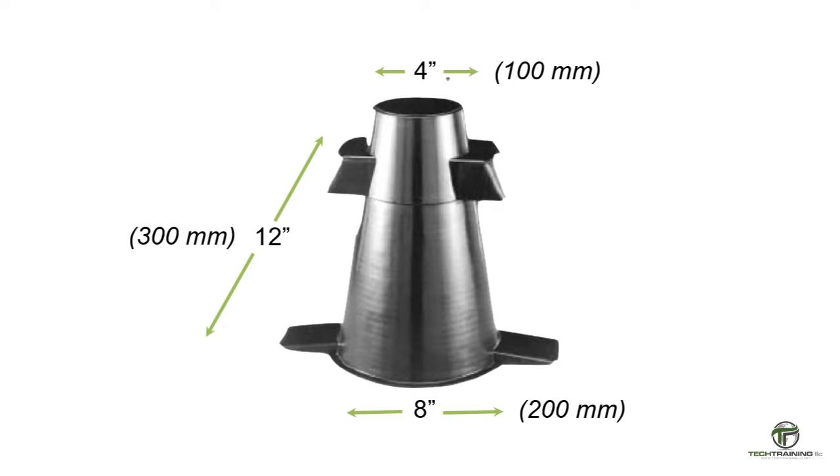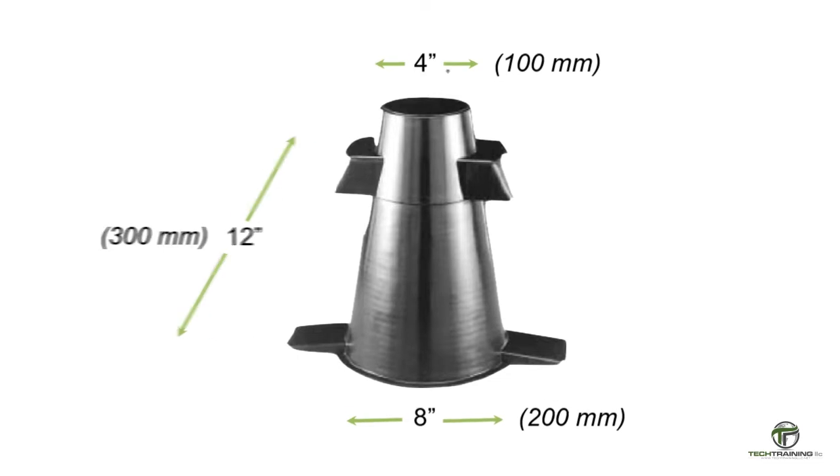The interior of the mold shall be relatively smooth and free from projections. The mold shall be free from dents, deformation, or adhered mortar. A mold which clamps to a non-absorbent base plate is acceptable, provided the clamping arrangement is such that it can be fully released without movement of the mold, and the base is large enough to contain all of the slumped concrete in an acceptable test.